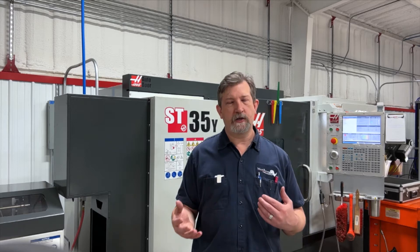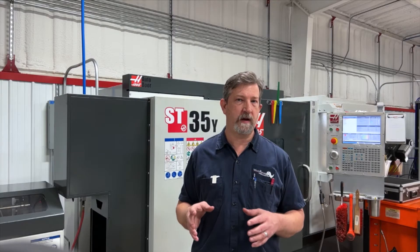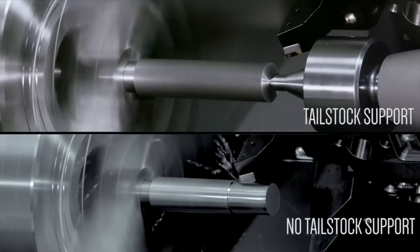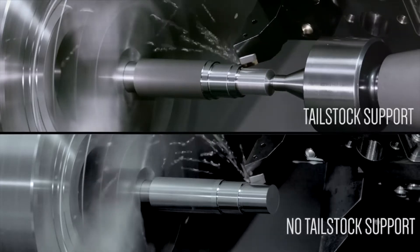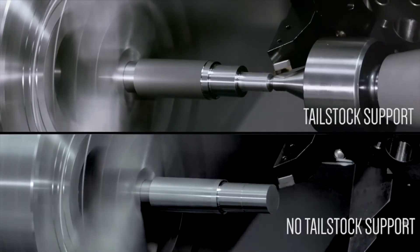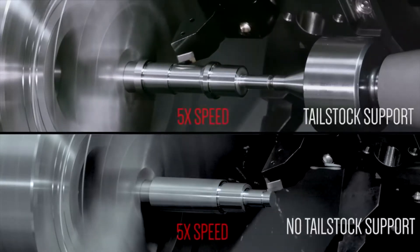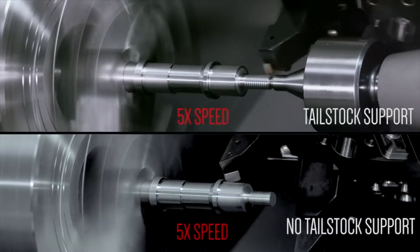Here are five things I like about this lathe. I've really struggled deciding between a tailstock and a sub spindle, but I really like the programmable tailstock. If I'm running a part that needs tailstock support, I can do a short push, machine where it's most rigid, then push it and do a tailstock advance so it supports through the whole way. I can do a long part with short pushes and do it all from the VPS.